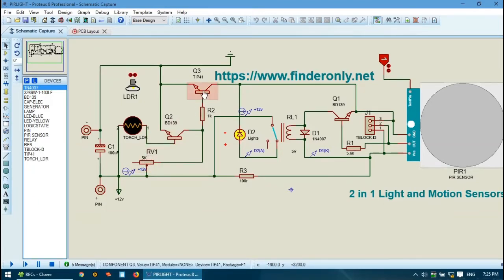The next part uses a TIP41 transistor as a current enhancer, because the current flow from the circuit is slightly low and needs to be boosted to make the current power bigger. This BD139 transistor serves a similar role. It doesn't matter if you want to change these transistors to any other model — of course, it has to be an NPN transistor.